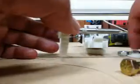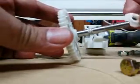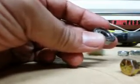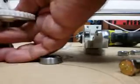bolt. Now, in a couple of additions that I added to the UniX design are these little spacers. The reason for them is so that if you were to use a washer to space your large gear, chances are the washer is going to be rubbing a little bit against the parts of the bearing that are not spinning, rather than the shaft in the middle, which does spin. So this addresses that by reducing the surface contact. It can take the place of a washer, and then it fits right against the spinning surface and doesn't touch the flat part of the washer that doesn't spin with the center shaft. So when I'm hobbing a bolt, I have to include those in the stack of pieces that go in there.